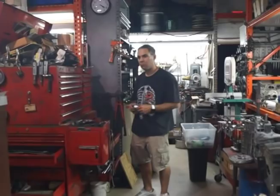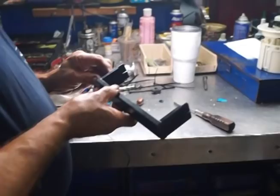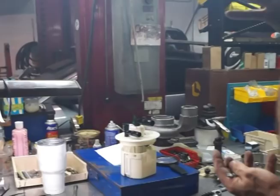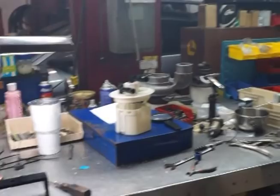Again, you just open it up. We're missing the baffle. We need to fix the key. Make the key an inch taller. That's it. We cut that, we extend it, we put it on there, two C-clamps, one top to bottom, one side to side, and we re-tack it, weld it, you have your new tool. It's aluminum. Just cut it and stack it up 1 inch. Put a little insert in there. Put the cap back on, clamp it from the sides, clamp it from the top to keep pressure on it, that's it. Tack it, beat it, done. A little 1 inch piece of quarter inch. It'll be done. But for now, whatever. I mean, we could get by now, but I need to make that. This is already done. All I gotta do is extend.